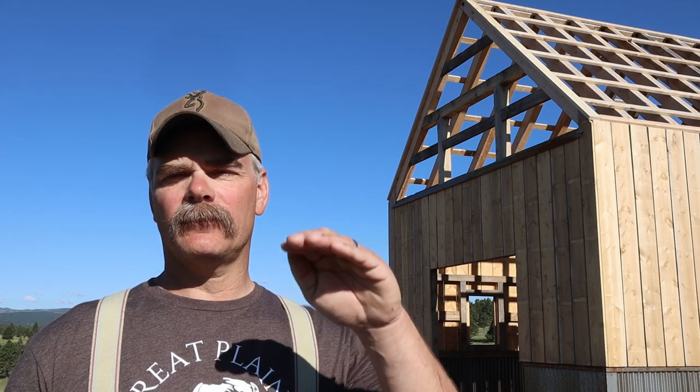And then I had to take off the original eave boards that I used for nailers for the steel roof and put on solid pieces, because the 45 bevel that I put on was basically going to leave a giant hole where I wouldn't have any fastening space for the steel roof flashing. How that taper came down and where the siding was coming up, it wasn't long enough to taper fully to the top. So I had a big void there, and once I put the battens on, the void would have been bigger. It's kind of a long, convoluted problem.